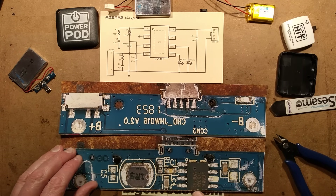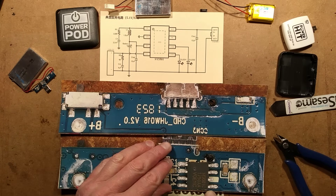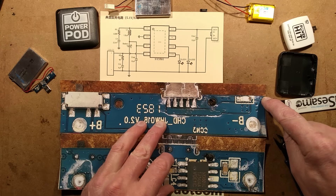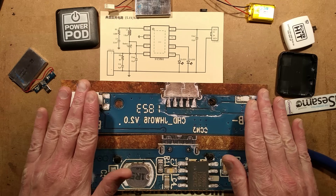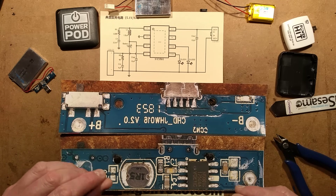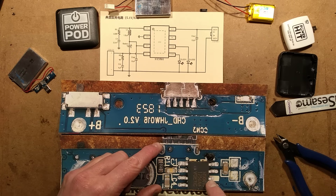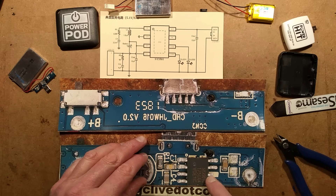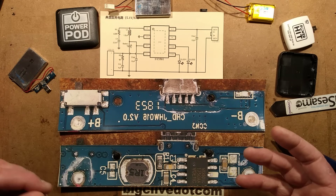Here's the SY3501, and it's got these two pins down here. One at the bottom is going to LED one — it's going along this track, disappearing through the circuit board, coming up the other side. There's the LED with respect to ground. This thing is a large ground plane on both sides — it's quite a nicely designed PCB. The other LED pin just floats above the circuit board, so it's not connected. If you connect an LED between those pins in charging mode, it would show you the thing was charging and when it was charged.